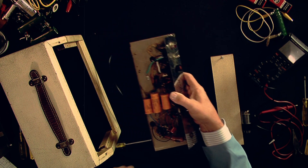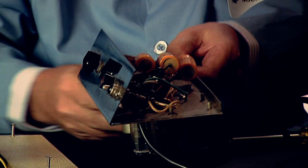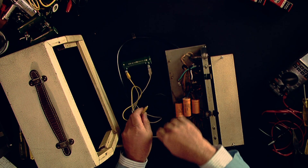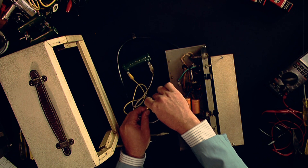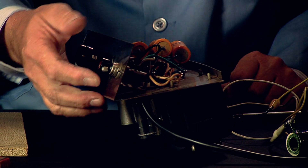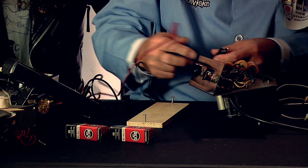We'll have to take the chassis out and dig a little deeper. Put the tube back. Now, tube amplifiers cannot be run without a speaker connected, so I'm going to use this load resistor. It presents itself to the amplifier as a speaker would, so we don't actually have to have anything making noise. We'll turn it on and let it warm up.